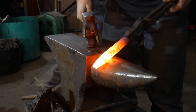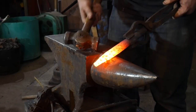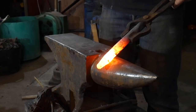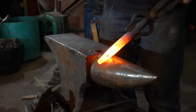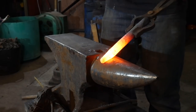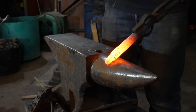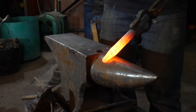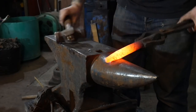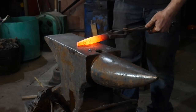We probably want to take that to about 10mm square at the end, or 3/8 square. Now I'm coming in on the flat side of the hammer to tidy everything up and develop a bit more of an even taper, because the round hammer allows us to squeeze the material out like between the thumb and finger, and the flat side just planishes everything — it hasn't got as much pressure as that round side.